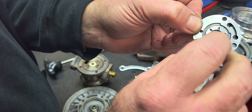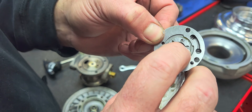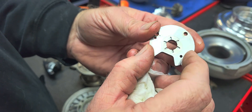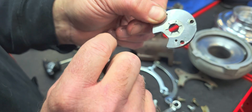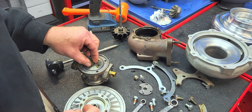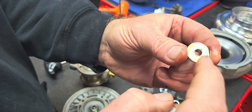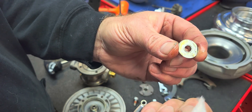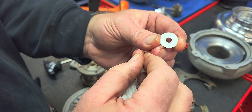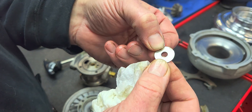This is very strange — you can see here on the thrust pads we've got some small material touch-off, but on this side we definitely have contaminant embedded in it. A contaminant could be — we're not going to speculate, we're going to look. Because here we have very clean oil, and that thrust washer is literally mint.